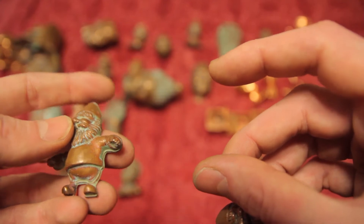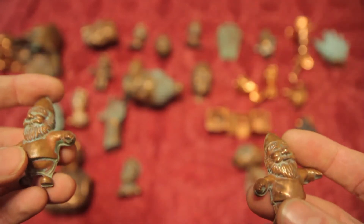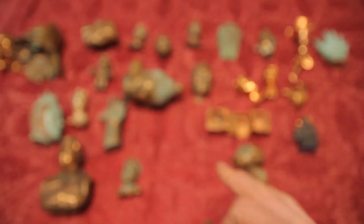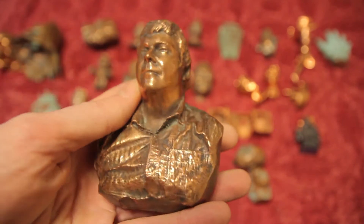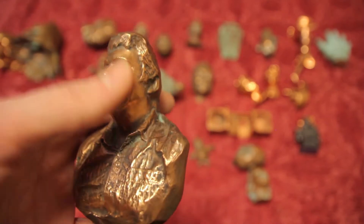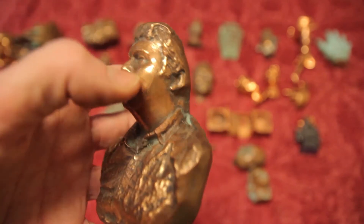The actual look is not much different but the cost is dramatically different. A little vial of silver is about eight pounds, as opposed to an entire spray can or pot of graphite powder for about seven pounds. I did pretty much all of this with one or two spray cans of graphite. This one was coated with a copper spray — I haven't tried the nickel spray, but as long as it's conductive it will plate the same, and if you leave it in long enough you get that shiny look.